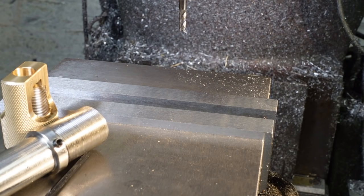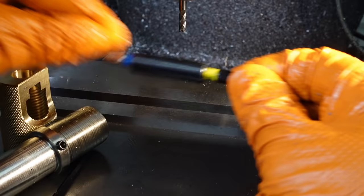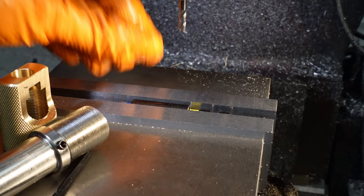This is the magnetic bit holder that I'm using, and I remembered that it needs a slot milling. Yay for me! The end mill is a 4-flute 4mm carbide job made by YG1. I haven't broken many of these yet. Look, I'll be gentle, okay? It's made of tungsten flipping carbide, and the steel doesn't stand a chance, honest.